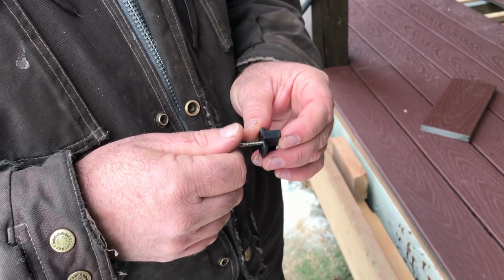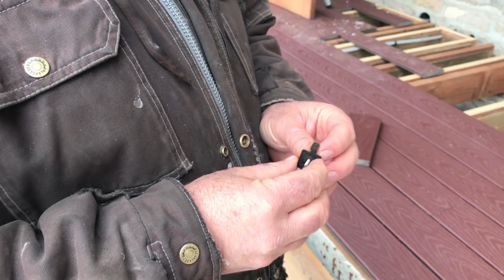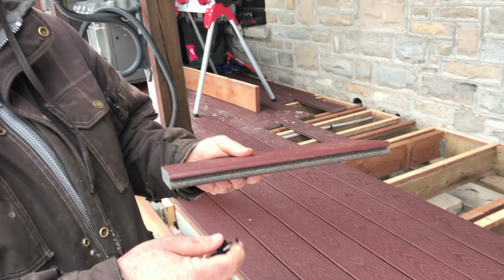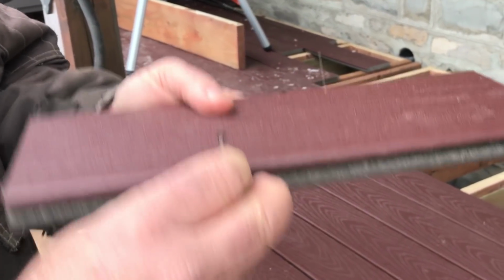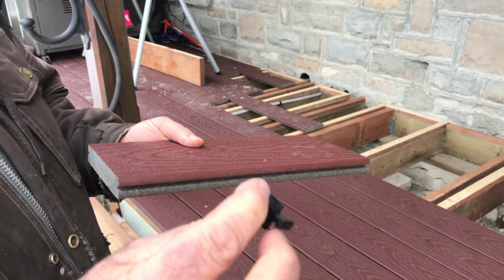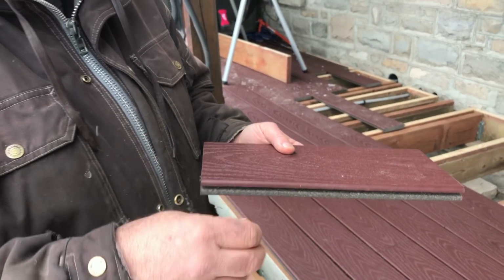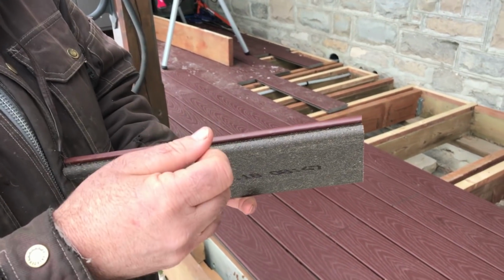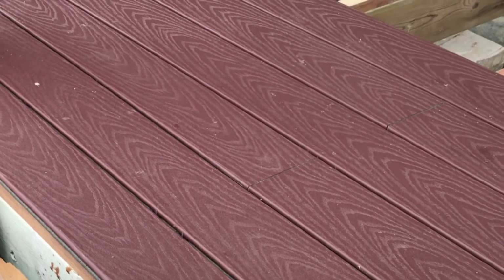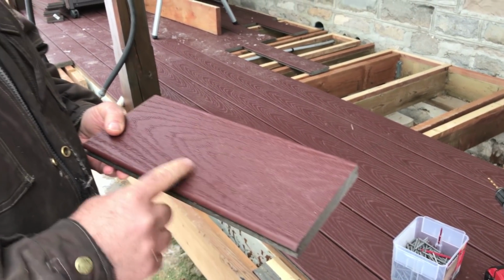They look kind of gimpy. I mean, just pieces of little plastic. Might those not break or get brittle over time, or with kids jumping on the deck or something? The deck board is still resting on the top of the joists, so it's not bearing any weight. It's just holding it down. I haven't used these before, so I really don't know how they age. Trex is a really good brand, though, I'd be surprised if there's any problem. I have used other kinds of plastic clips over the years to hold composite deck boards down, and they've lasted perfectly. I can't over-stress how much better an installation like this looks when there are no visible fasteners.